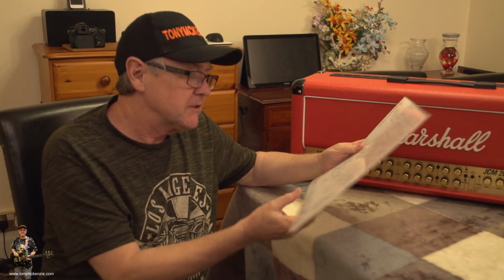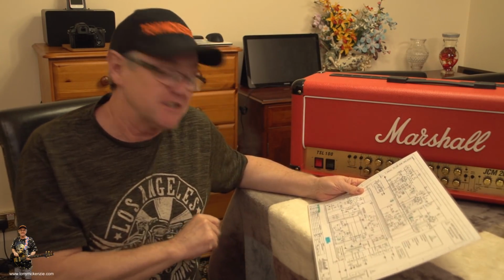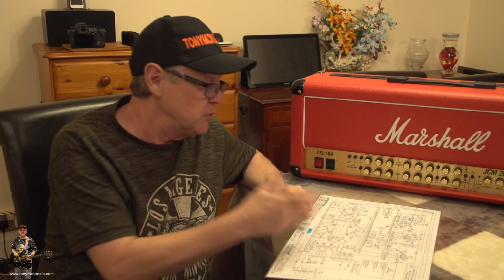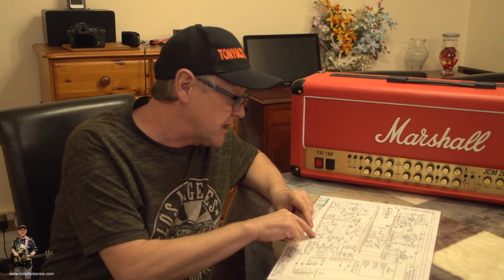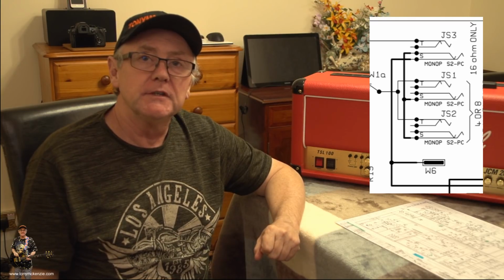It all relates to this capacitor, C46. I notice on the newest board, the issue 20, that's actually 1 kilovolt. So it's been increased in its power rating, or its ability to work at higher voltages. But they still fail.